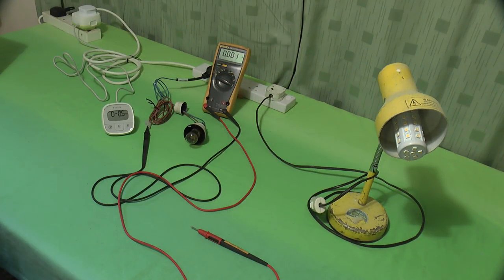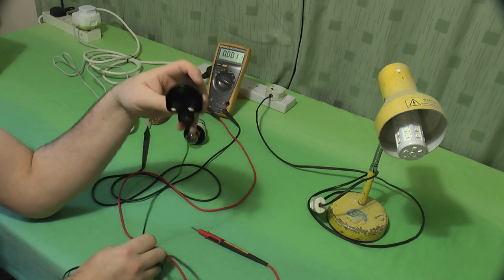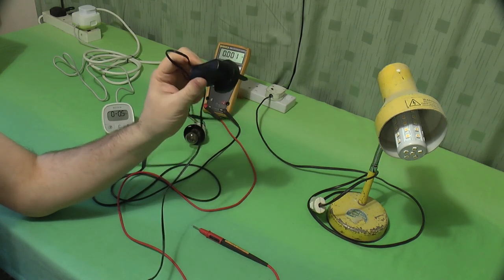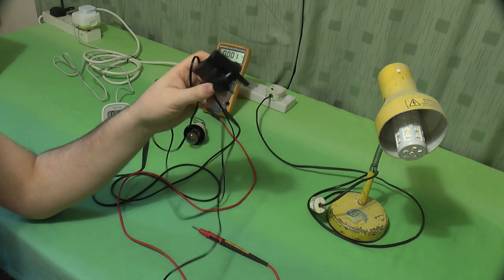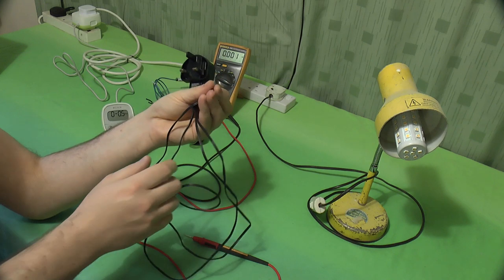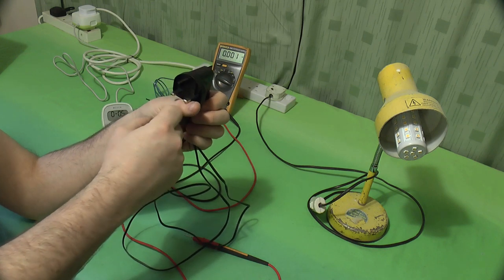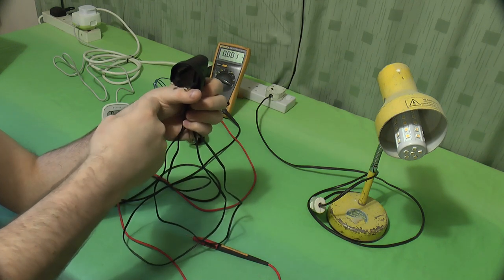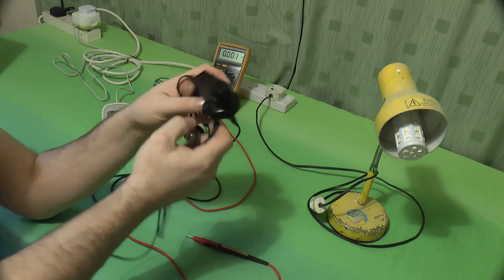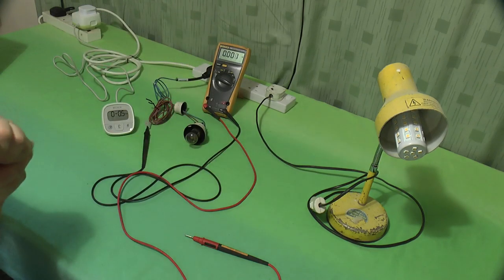Now, I could give you an example of high voltage coming from the power supply, but that means nothing. I can get around 100 volts leakage voltage from this plug top power supply, which came from a Zyxel branded network switch, so quite a quality branded switch. I won't get a shock from this. What I'll find, if I'm touching it or the metal case, and I brush my knuckle against something grounded, such as the light switch, is a sort of roughness, if you like. You can feel the mains hum as you move your knuckle across. But there's nothing wrong with that. I can get 90 volts off that, no problem, but the current is so low, it's not a problem.